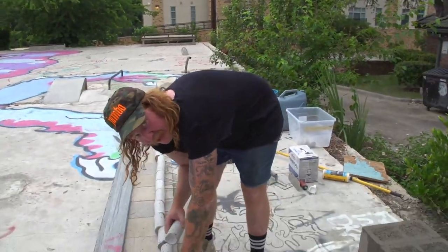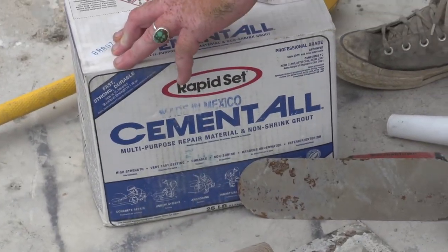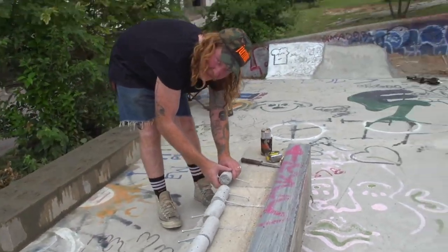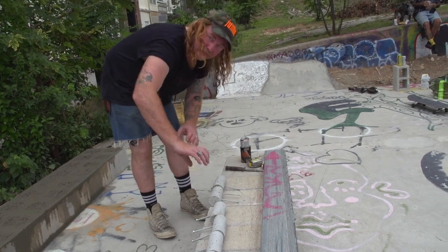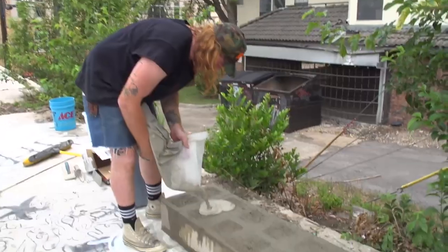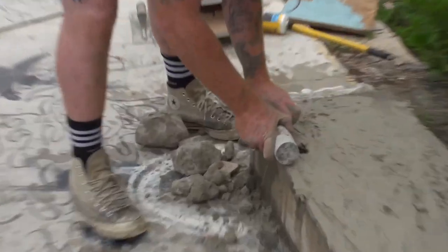Now that we've got it kind of packed in — it doesn't have to be completely flush, there's gonna be a fine layer of mortar on top. If you're not building your own ledge from scratch, you can find the top of a bank, a ledge, pretty much anything you want. What we're essentially going to do is lay a bed of mortar down. In this instance I'm using CTS Rapid Set Cement All, which is a really fine cement — it cures really fast, dries really fast, and dries really hard. You can also just lay a bed of mortar, snug these guys in, fill in the cracks, pile it around, and you've got a nice ledge.